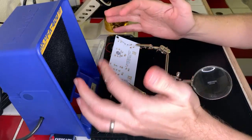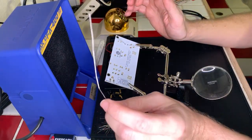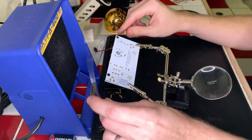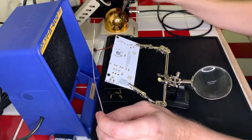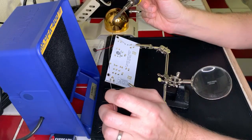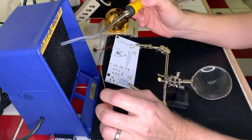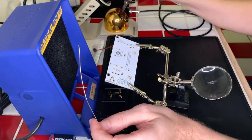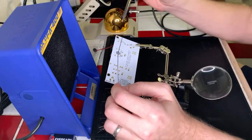But we just soldered those three capacitors, and we're going to solder the last one here really quick. And then we'll be done with that, and I can connect the power and get a battery on that, and we'll see what it does. So let's go ahead and get my soldering iron. Looks good already. Looks fairly tinned, but I'm just gonna, for caution's sake, get some extra solder on there. Clean it. We want a nice shiny tip when we are soldering, because we want the heat flow to be really nice.